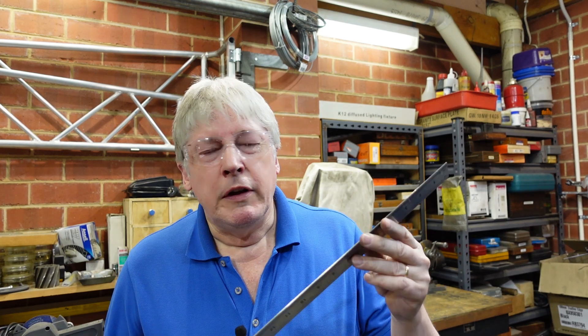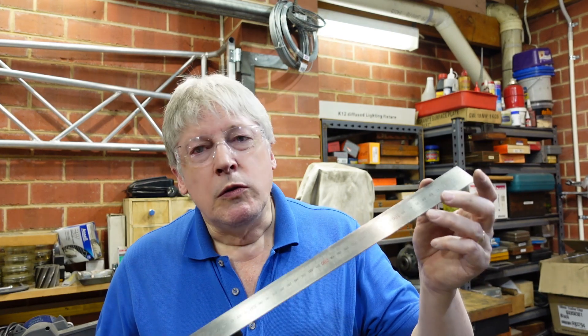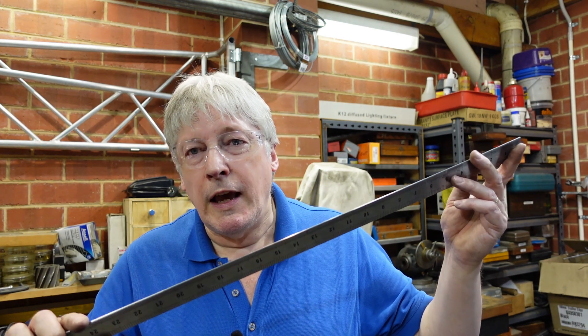Like most people I've got a set of digital calipers. These ones are an eight-inch set and that's usually about as big as I need to go. I have got an old-fashioned vernier set that goes a little bit bigger. Every so often I've got a long thing to measure and I don't quite trust my ability to line this up on the center of a hole or on the edge of a shaft or whatever. So what I'm actually going to do is make up a couple of sets of stops that will do that, but also with some tails on them so I can use them as an impromptu set of calipers for something like this.